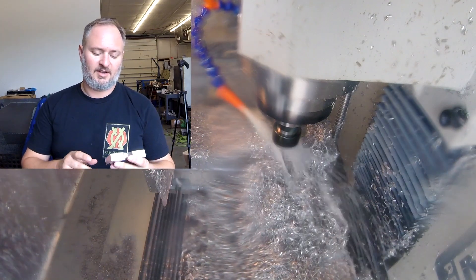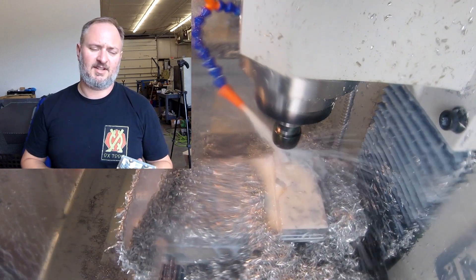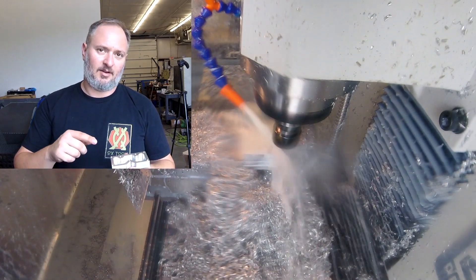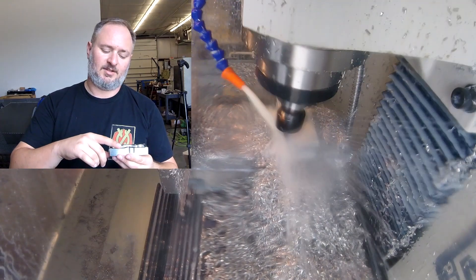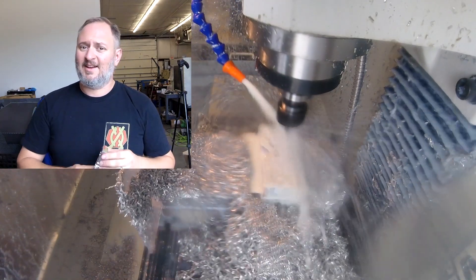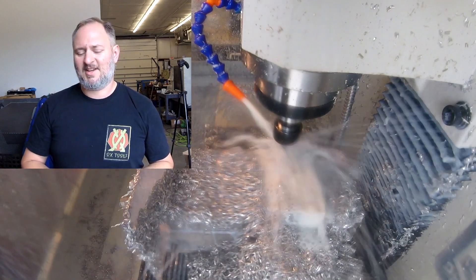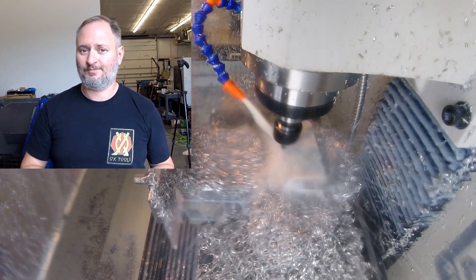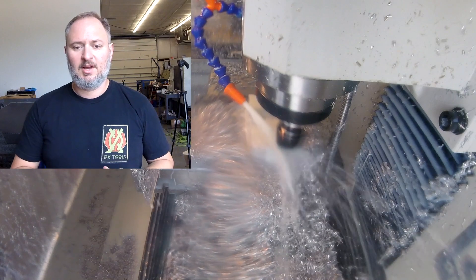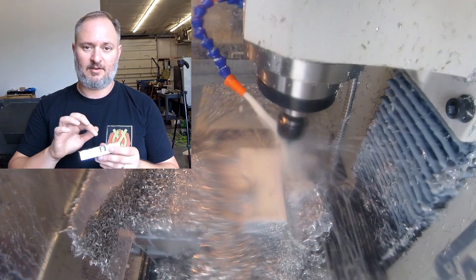In this final version, I told it to do half-inch cuts. I kind of worked my way up to it — first I did half of the tool diameter at a higher speed, then I went to full tool diameter, then half again, then a full three-quarter inch depth of cut. I found that at full depth of cut the machine stalled on me — I just didn't have the horsepower. Or I was taking such shallow cuts that I wasn't really engaging the cutter, and that's not good either. We don't want to baby these cutters. Eventually I settled on — I figured out I could do it in about two passes.